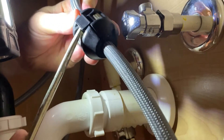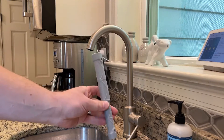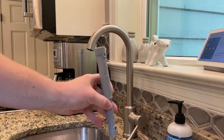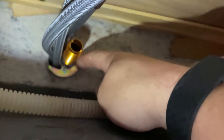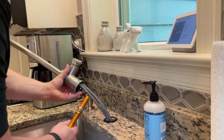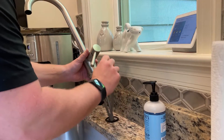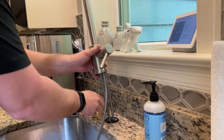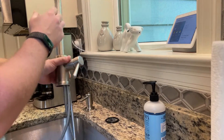Taking a flathead, I'm just popping this piece so I'll be able to take this all the way out. I'm going to take this tool, put it up underneath, and then take an object like this and simply turn it. Now the whole thing moves, so I'll be able to unscrew this the rest of the way by hand. This part underneath actually just unscrewed from the base, but normally this should stay connected and the bolt should come unscrewed — either way it works, it comes out. Pulling my cold and hot supply lines out, and finally this piece that we had disconnected, and now the head.